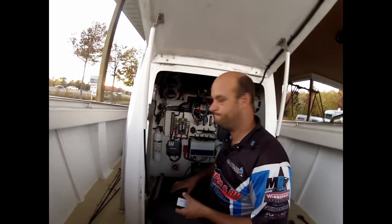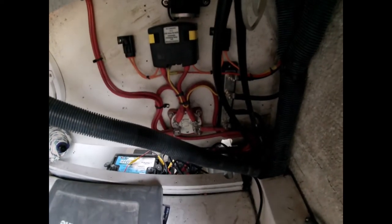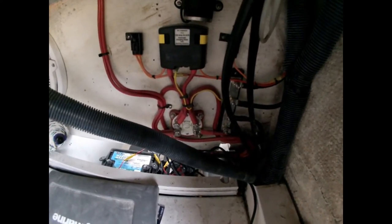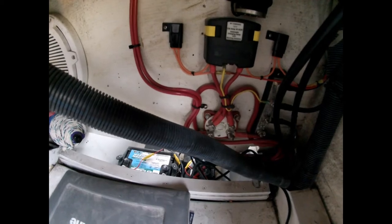So let's go around and look at that battery switch. Right there is the battery switch we're going to connect to. We're going to connect the battery monitoring wires to each of the red terminals for each battery, and that's going to not only give the boat command power but also give us voltage readings from each battery.